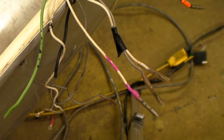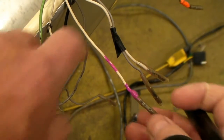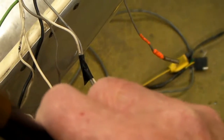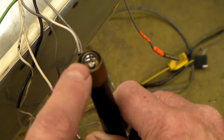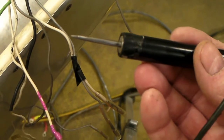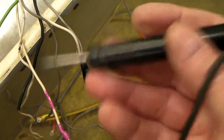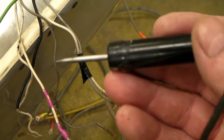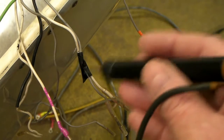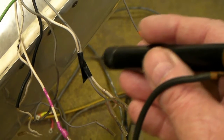To check these things, I usually just use a test light like this, so when I find the right wire, this light bulb will light up — just by touching this probe to something. It's just a simple circuit tester, and that's how I find out what wire in the back comes out where, because there's a lot of EGT probes here.